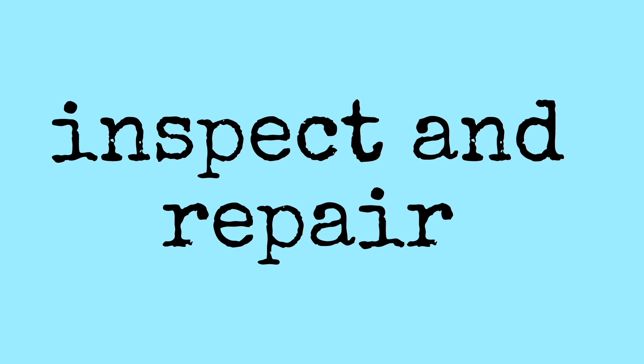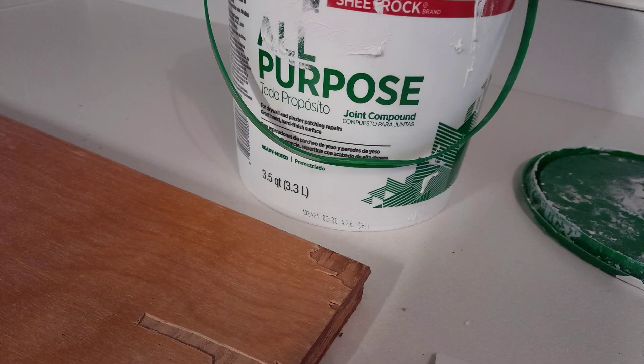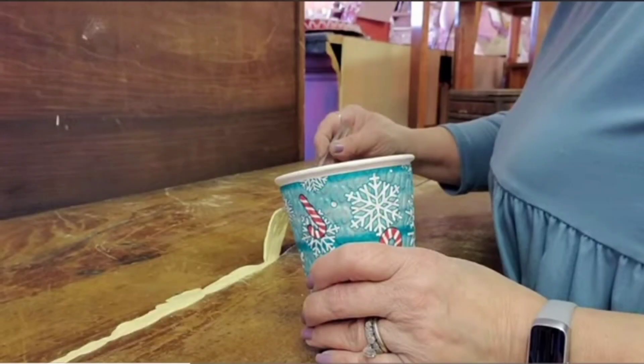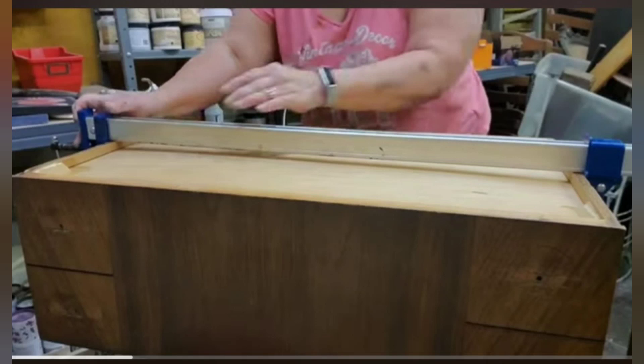If it's for a client, you want it to look good and smell good. You can also use scented waxes to refresh the drawers. Inspect and repair is really a critical step. Most kitchen cabinets are going to be okay, but not always. I was working on this bathroom last week — didn't even realize until I got there that they were water damaged and the veneer was peeling. This dresser had a big split in it and I used Durham's wood putty for that. Sometimes you can wood glue the drawers. As you go on, you'll understand more what it takes to repair and gather more tools and glues.